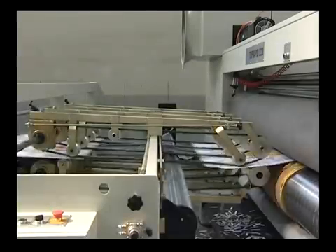Automatic Stacker: The collection speed of paperboards is synchronized with the speed of the main motor. It can also be adjusted independently. Pneumatic side jogger squares sheets. The hopper supports a maximum stack height of 1,700 millimeters. An anti-falling device is used for operator safety as the stack rises.